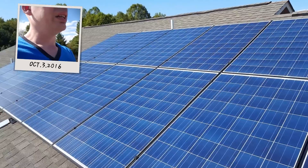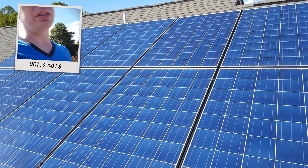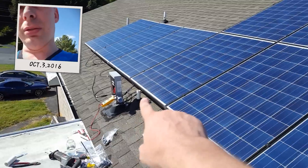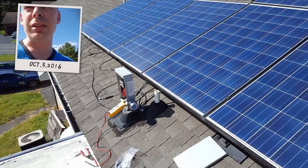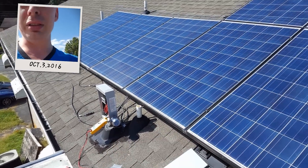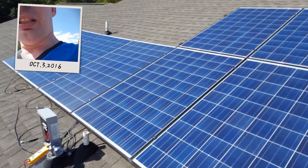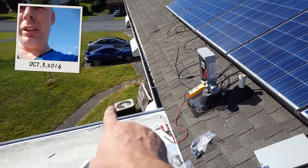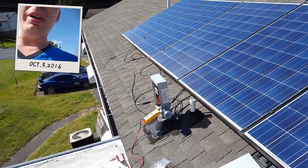Today I was receiving a peak of 3,500 watts with just 3,000 watts hooked up, then it went right back down. It peaks well but doesn't maintain that. Somebody mentioned in a comment before that I should cut that pipe down a little bit — you can see where the shadow of the disconnect box falls on the pipe. If it does shade the panels, I'll have to scoot them all up a little bit, at least this row.